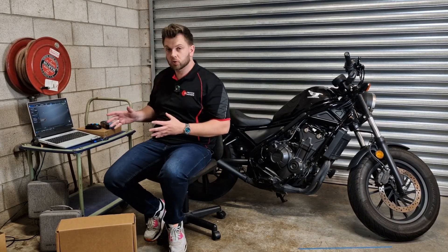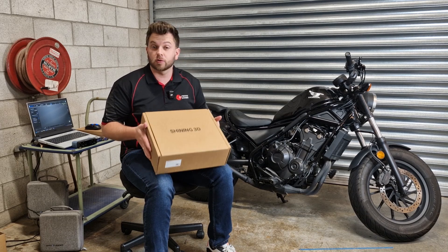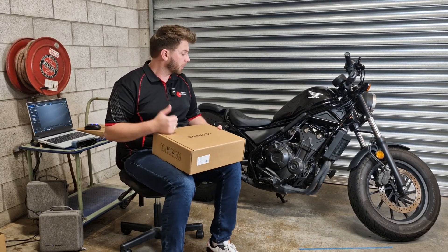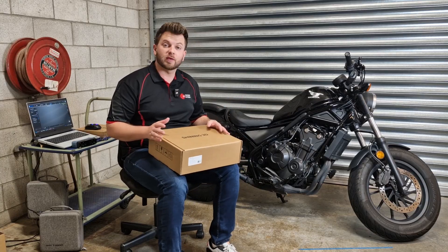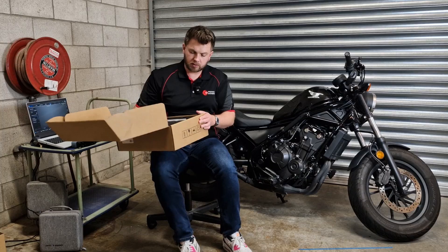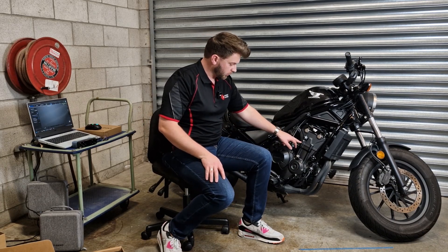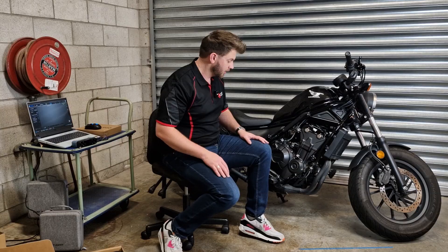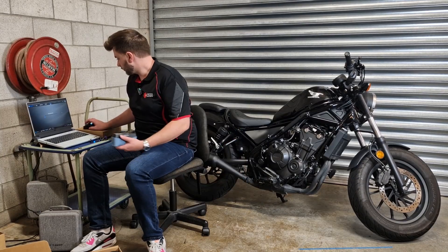To get started, I'm grabbing marker dice from the new Shining 3D Accessory Pro Pack. They come with a turntable, marker cards, individual magnetic marker dots, and a bunch of marker dice. I've placed a couple of dice on the bike in places where the geometry might not be critical — for example, if you're creating a new cover or guard. Obviously if you needed to recreate a bracket to mount to bolt holes, you'd position the markers away from those areas so they remain accessible to the scanner. You've got to pick placement carefully, then optimize the global markers and scan the point cloud.